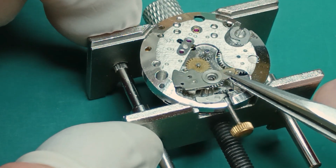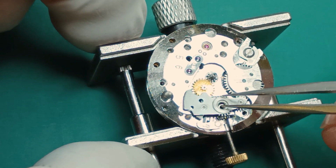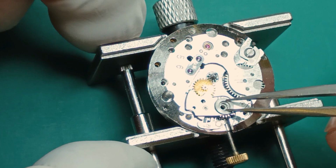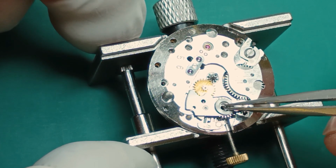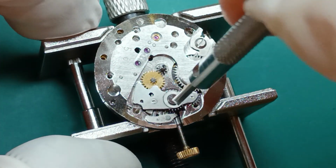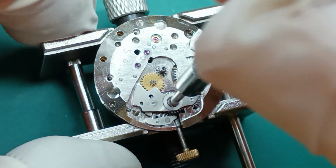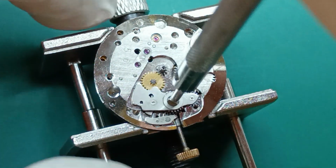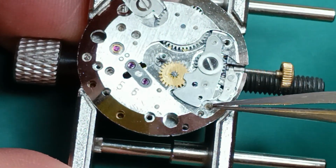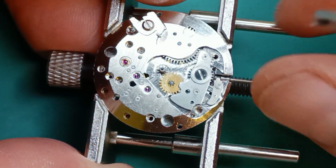As you see, one wheel winds the ratchet wheel, connects with the ratchet wheel, and the second one with the intermediate wheel. Let's tighten this with the screw. The screw is the same like this one that is holding or securing the bridges on the other sides. Okay, not too much. And the spring here, the one end of the spring should come to this hole.